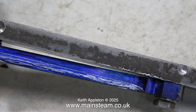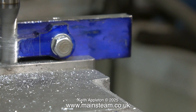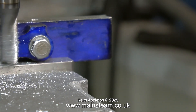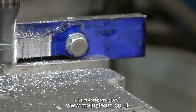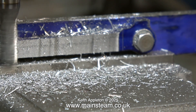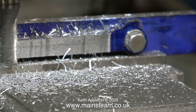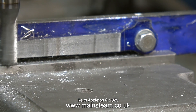If you look at this you will see that the line is parallel to the piece of steel that it's mounted on. With the steel bar firmly clamped in the milling vice I can commence the milling operation. Once again you have to take light cuts — when I take heavy cuts the thing really chatters, because after all this very small component is only held in position by a 4BA bolt and a 2BA bolt.